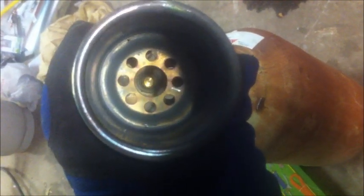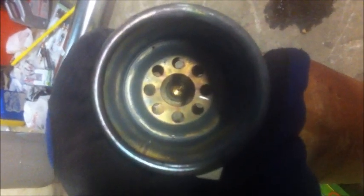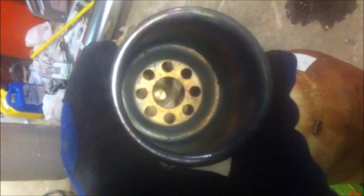I'm going to start by cutting a hole into the propane tank. This head just unscrews here, and I'm going to use it as my burner. As you can see, it's got a little jet down in there — I think it's a size 54 drill bit, so it's a pretty small jet. As the high-pressure propane squirts in, it comes out that big hole, and as it starts to burn it sucks air in through the backside and through those holes, creating kind of a loud jet-engine type of noise.